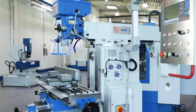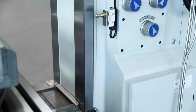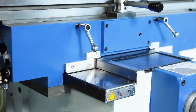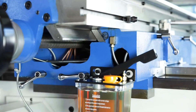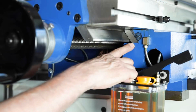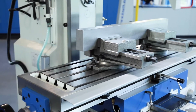This is a robust machine with large travels on axes for milling and drilling operations. The machine bed is a heavily ribbed casted construction with extra wide rectangular guideways on the Y and Z axes. The longitudinal movement is done on strong dovetail guides which efficiently absorb the vibration under heavy loads.